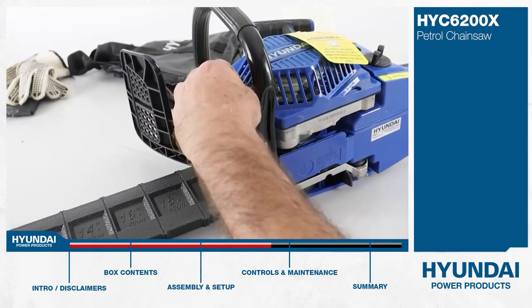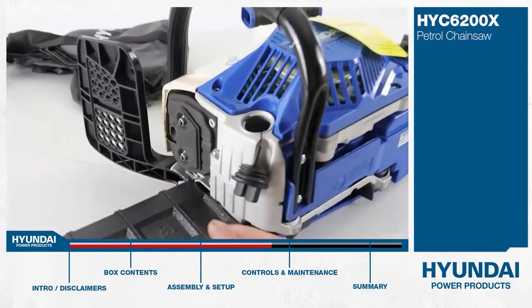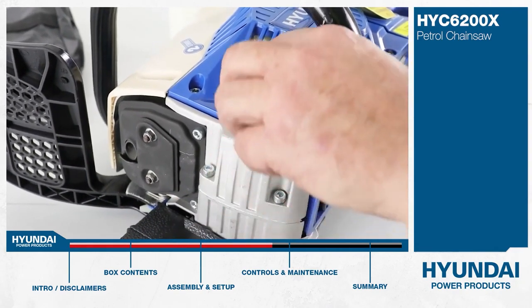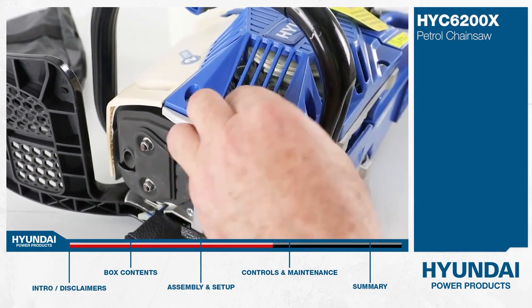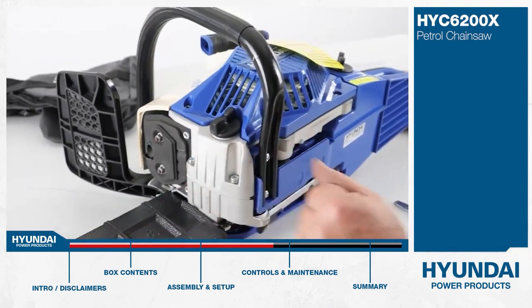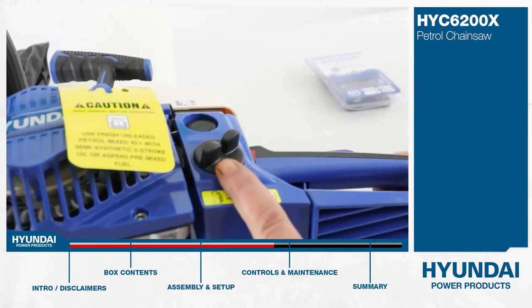We would unscrew the cover here, anti-clockwise direction, fill this chamber with chain lubricating oil, and once it's full, probably wouldn't fill it to the very top, just below the top of the reservoir there, we can refit the filler cap. Have I got that right? Yes. Nice and firm so we don't lose it. So that will be the chain lubricating oil. So we'll move on now to the fuel.